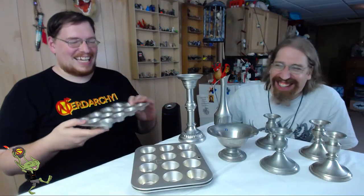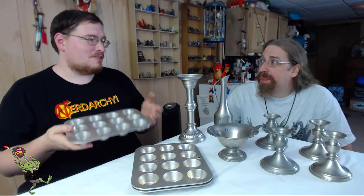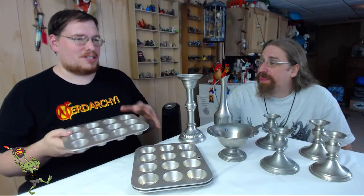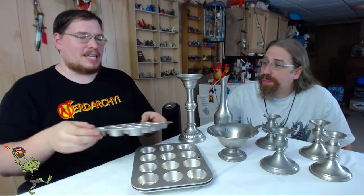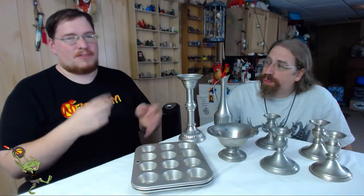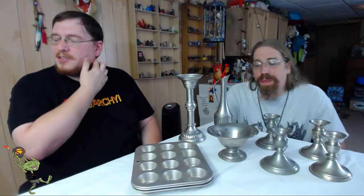Well, an ingot is basically a section of metal that you specifically melt, let solidify in a mold, and set aside so that you can easily just say, well, I need about 5 or 6 ingots worth. And you kind of know what the weight of your ingots are, and you can say, all right, well, I'll just grab 5. Rather than sit there and melt and weigh out your metal and do all these calculations, you just go, oh, well, 5 of these worked last time. I'll do 5 this time.